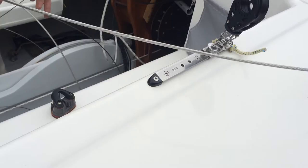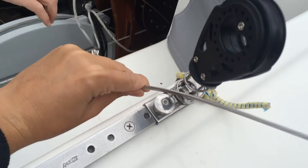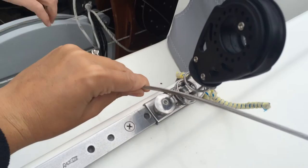Of course, you can put it wherever you find it comfortable for trailering. We like to leave our sidestays hooked up, so we go ahead and just lay them across the jib car track on the car itself, pinned between the pin and the spring. We then pull it forward and hook it over those wooden cleats — or perhaps you have plastic cleats on the side of your stanchion — and then use the tail end of any line, your topping lift or your spinnaker halyard, to secure those in place. You can also take your jib sheets, tie them off around that block on the car, pull them tight and cleat them, and then that block will lay over the sidestay and pin it in place so that it cannot chafe.